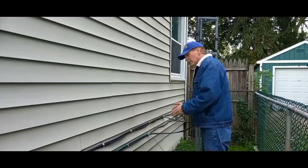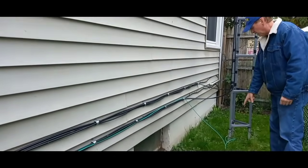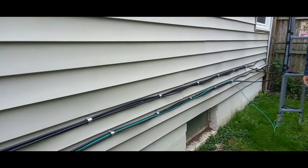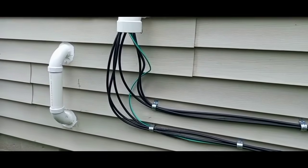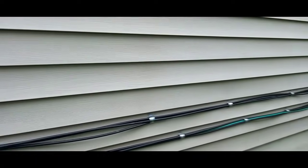And then it goes alongside the house. We've got the grounding system down here — an eight-foot ground rod. That's going into the desk for the radio room, the ground bar underneath the desk. Of course, the tower is grounded, and the ground rod also.